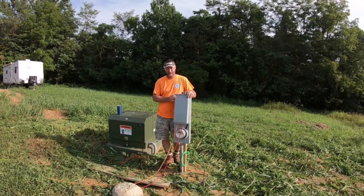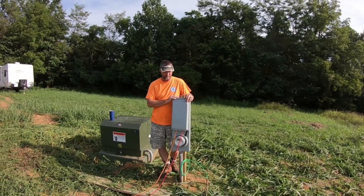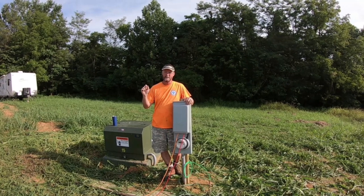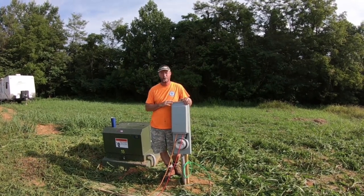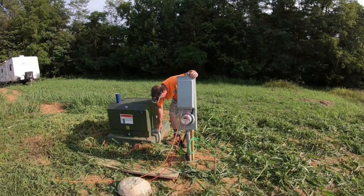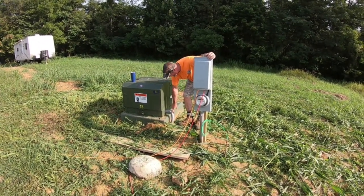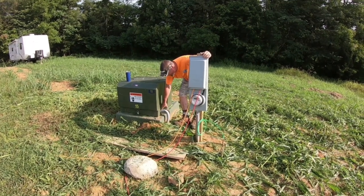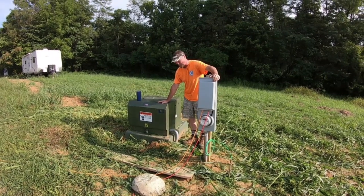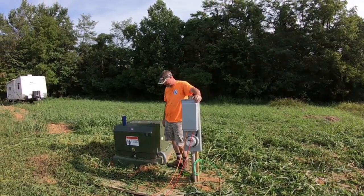When the building inspector came, he inspects the temporary service. That's the inspection you call for, temporary service. And if he says yes, it looks good, he sends a message to the electric company and says, come hook it up. The electric company then goes and installs this type of electrical conduit. It penetrates their hole, goes inside, and they tap it into the transformer. And at that point, this is hot and ready to use.